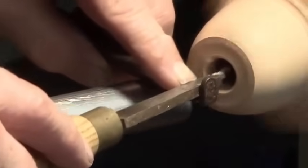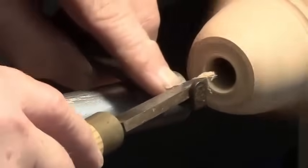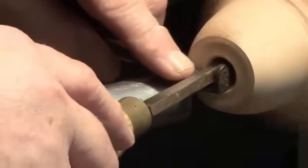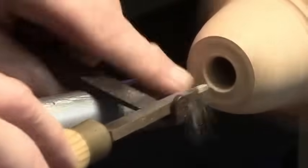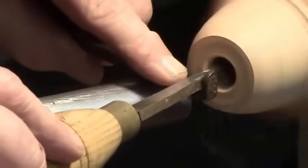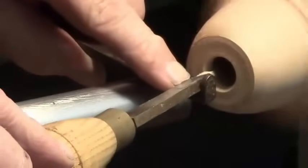It's about rhythm; it's muscle memory. Different pitches require different speeds — both lathe and person. What you have to do is recreate the travel of the thread. The coarsest thread I've ever chased was a 5, the finest I think is a 40.